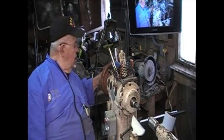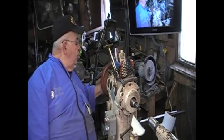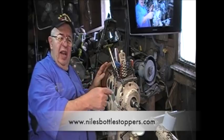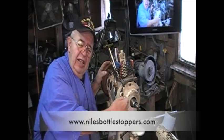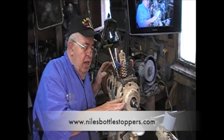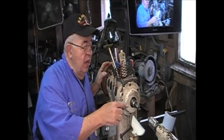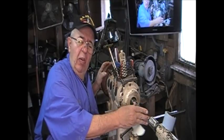All right, don't wax it. Right now, I'm going to line this up. It is threading into the bottom of the number 2 Morse taper, into the bottom of the stopper. Then we're going to bring the nut up and tighten the nut down. Now, what did that do? Nothing happened over here. Nothing happened, except that number 2 Morse taper went into that headstock and was received and is being held in place. So now if I'm doing something like a knob or a fluted piece or whatever on that 3/8 inch, and this is a handy mandrel, don't forget this, more than bottle stoppers, if I'm making a cut this way, opposite, I'm not going to pull it off. It's going to go right where I want it to.